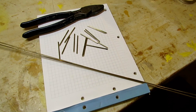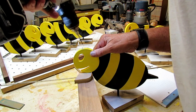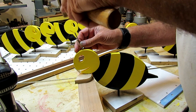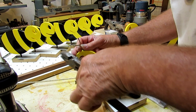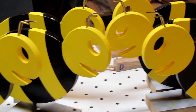I wanted to put a couple of antennas on them. I just took some old brazing rod that I had laying around, cut some pieces to the length I wanted, and hand-drilled on kind of two angles a couple of holes to put these pieces of brazing rod in. They should be fairly weatherproof because they're just pieces of brass. I tapped the brazing rod in, then went back and took a pair of pliers and gave them a little angle so it looked a little bit more like a bee's head. Once I got them shaped up, I took some super glue and super glued them in place. All eight of them now have their little antennas on them.